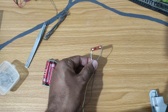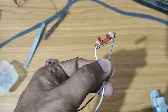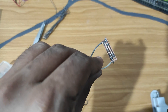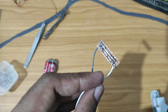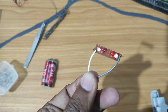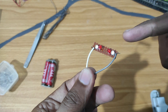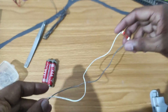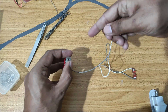So what have we ended up with so far? The LEDs have been soldered onto this piece of stripboard. The reds are at a slight angle, which is fine — we want the white ones to be more intense in brightness since they are the headlamps. It's not the best soldering job, but it'll get things done. This stripboard is a little faulty so I had to solder the LED legs to each other directly — it can happen with stripboard sometimes, especially if it's not great quality. You'll never know until you start using it. The white LEDs are connected one way and the red ones are connected the other way — that's how we get our directional lighting. The wires are really long because it's always better to have long wires and shorten them later.